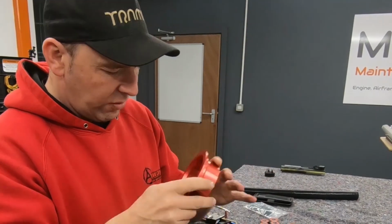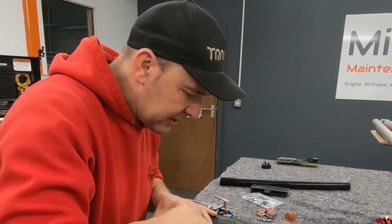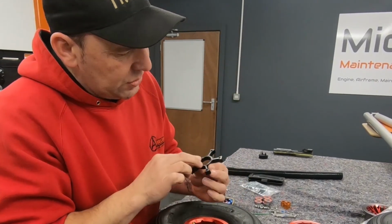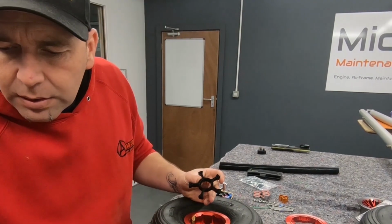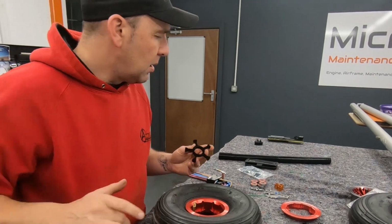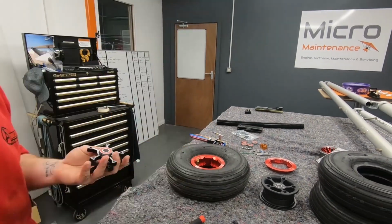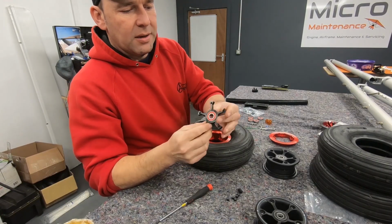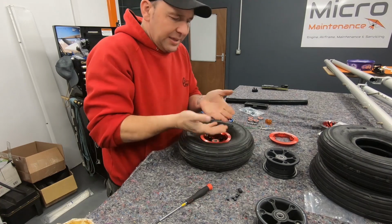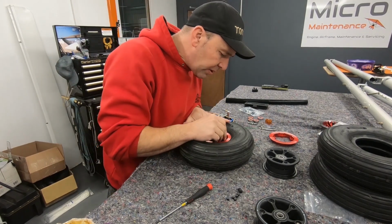There's a small hole for the valve, so we're going to locate that, drop that in place. We're now looking for the first of our spokes, making sure that you've got that the right way around. What I'm going to do is I'm just going to press in the bearing. And so we've even gone for colour matched bearings. So now the colour matched bearings have been pressed, can drop the first spoke in. And this is the outside, so this is the deep dish. See these bolts, I've got some thread lock in, so I'm going to drop those through.